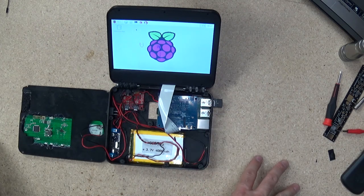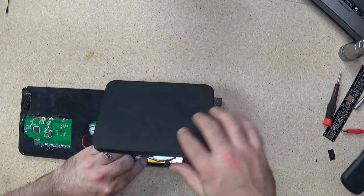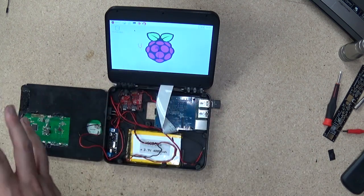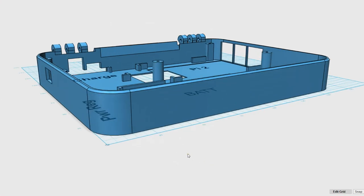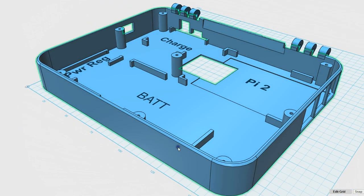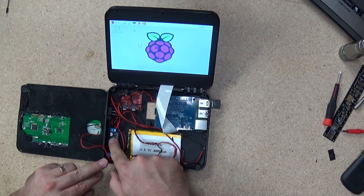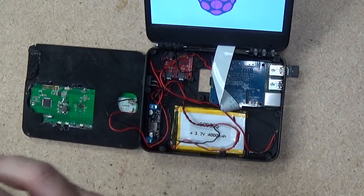On this project I actually spent quite a lot of time on the case design. There are four pieces: the bottom half of the case, the outer shell of the case, the front panel insert, and the keyboard insert. It wasn't really possible to print all of this in one piece, and it ended up being easy to assemble — a little more difficult to design, but very satisfying. Looking at the design files, the cutouts for the Raspberry Pi, battery, power regulator, SparkFun board, and switch have all been incorporated. The battery, SparkFun board, and Raspberry Pi don't even need additional support — they just sit inside those constraints and it holds them quite nicely.